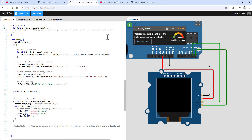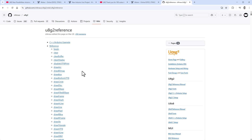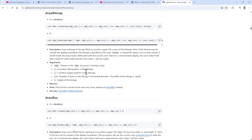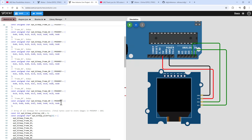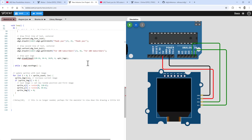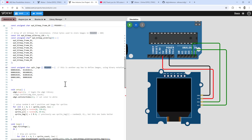When we start the simulation, there's a problem: there is no drawBitmapP function in the u8g2 library. Looking at the documentation, there is only the drawBitmap function, and that old function shouldn't be used anymore — it's from u8g1. The drawXBMP function requires a slightly different image format, and since I don't want to re-export those images, we can use drawBitmap instead of drawBitmapP.